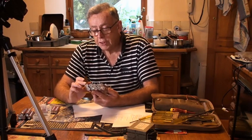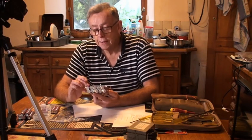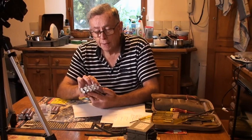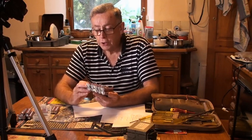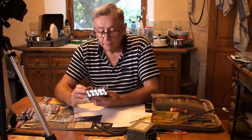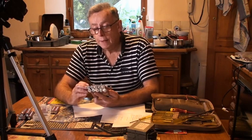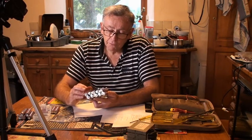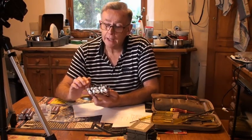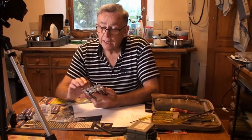35, and see that we've got capacity in them. Because there's no battery management system on this now, what I'll be looking for as they discharge is seeing that the voltage across each of the cells remains equal or very similar to each other. So I will discharge them only slowly, but I'll discharge them down to see if their capacity is in there and that they're charging evenly, and then we'll charge them again back up to their capacity again, and that will just confirm to me that the capacity of these cells is still there, and that we haven't got any weak cells in this pack.